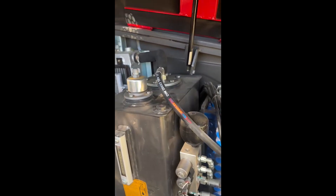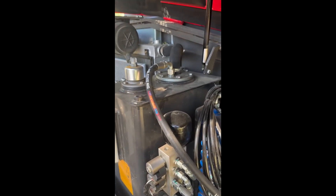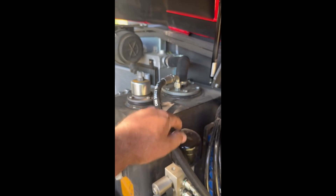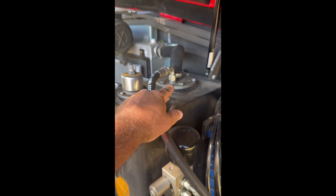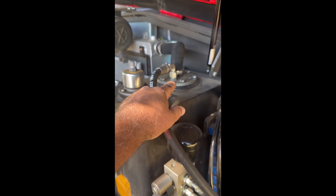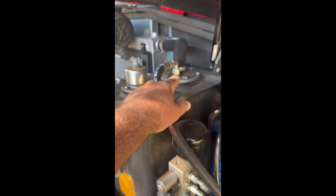This is the hydraulic tank on the side of the excavator. What I did was I just drilled a hole right here and put in a JIC fitting — it's either JIC or pipe thread, I don't remember now, but when you go to get your hose you can pick whatever thread you want.